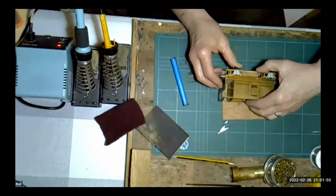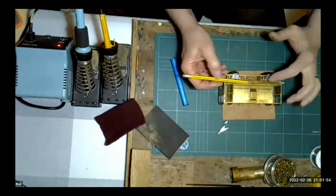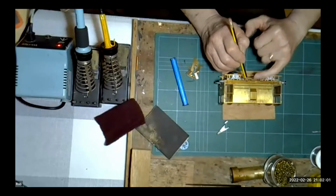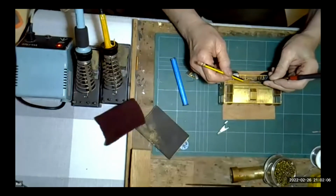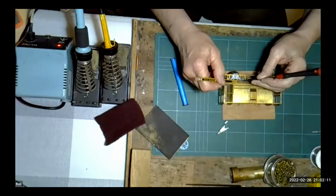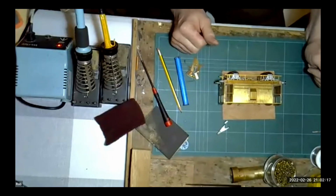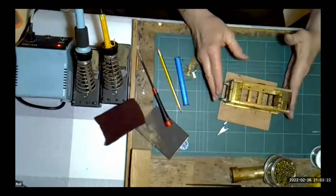If we take the case in point, something like this, we drop our overlay in with both pieces tinned and with some extra flux in, and then literally put the iron on and work towards the outside, probably holding it down with a screwdriver as we work along, and just let the heat go into the overlay and work towards the end. So if there is any expansion, it's being pushed towards the outer edges. That is about the best I can really describe that situation.